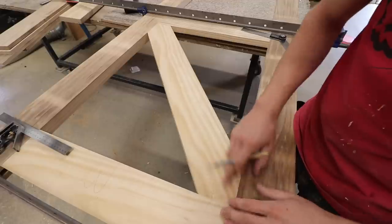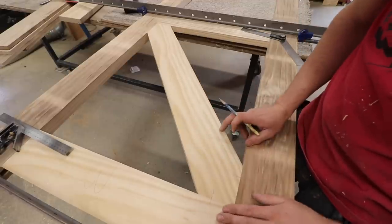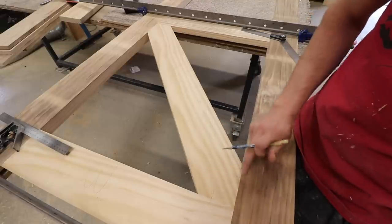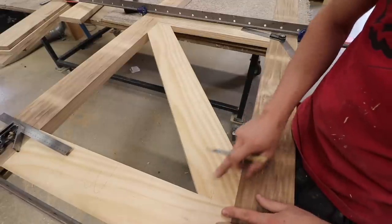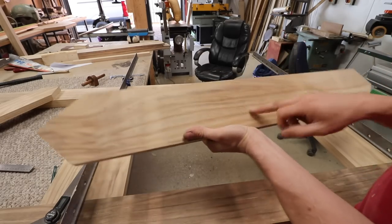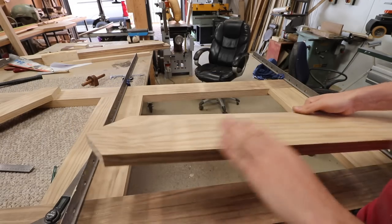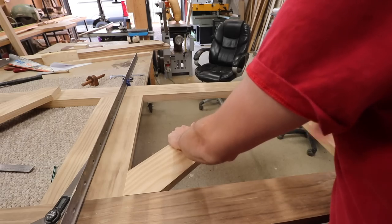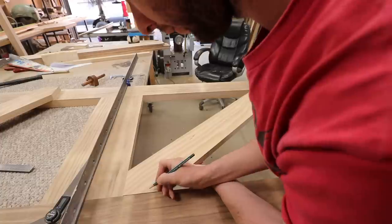We'll never get these in by starting the rails and trying to domino and drop it in. So it just doesn't work. So there's a very set routine for gluing this up with a double domino like this. But once it is glued together, it makes for a very strong joint. Make sure you label these top and bottom if you've got two that are either identical or very near the same, so that when it comes to glue up stage, there's no panicking from a double second guess. Which one was the top, which one was the bottom, and then it not going together.